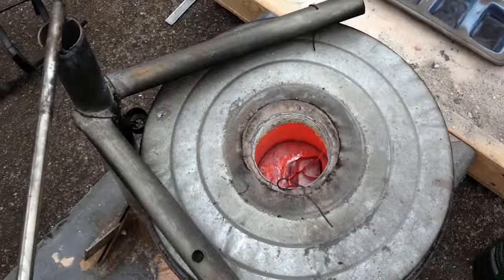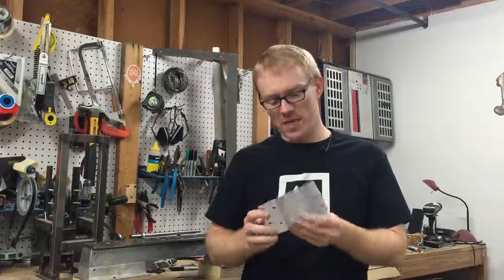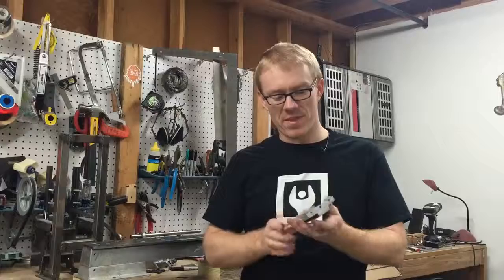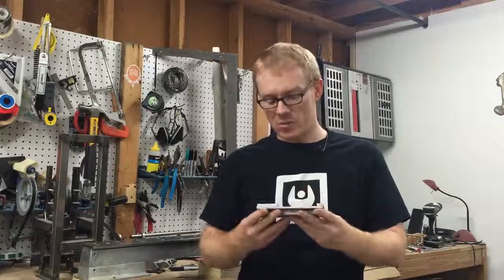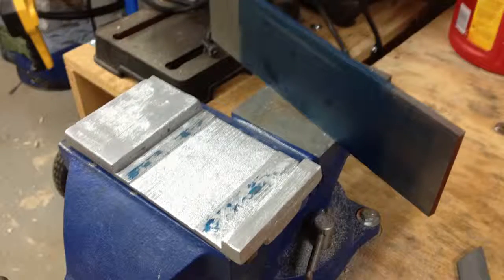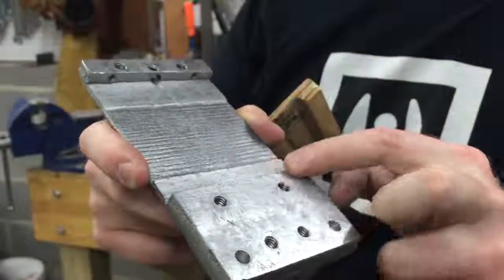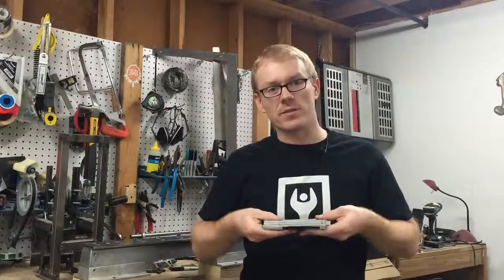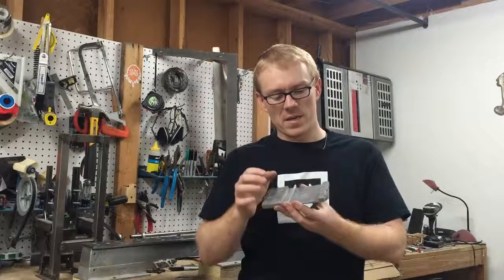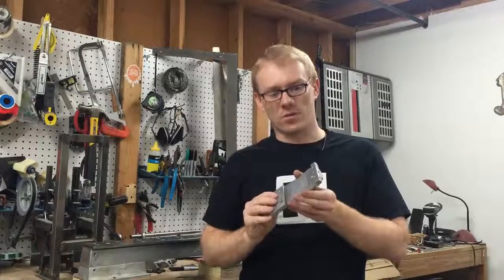I used wood filler to round out the inside corners — that helps it mold better in the sand. Once I had the part cast, I used a hacksaw to cut off the sprue, then a file and a rasp. Then I had to scrape the different surfaces. I started out by scraping the channel that rides on the lathe bedways, then the elevated portion where you mount the clamps. I drilled and tapped the various holes for adjusting the jib.